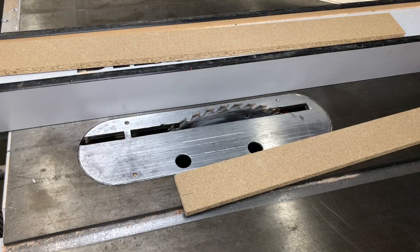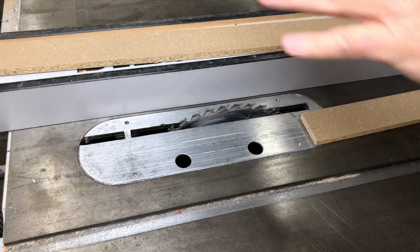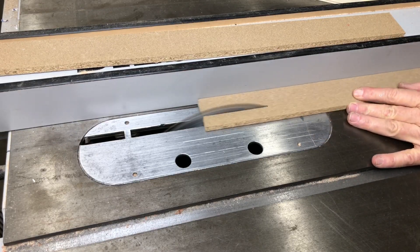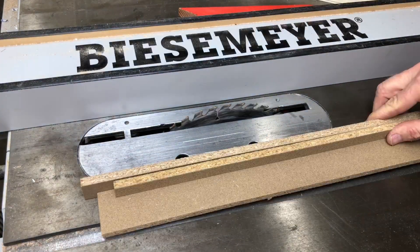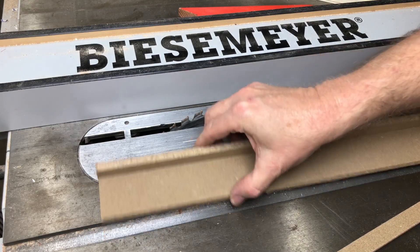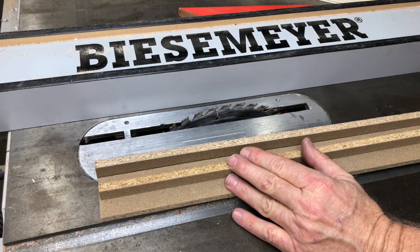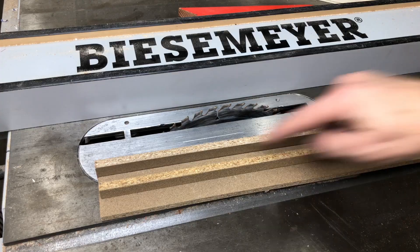To make the blanket mold, I'm going to need some strips of rubber. And to make those, I'm going to make a mold form that will allow me to just pour strips of rubber. This piece is going to ride on here like that, and this piece is going to ride on here like that — and that is going to form a strip mold.